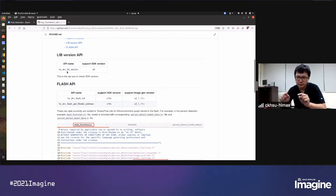And you can imagine that the 10 by 10 grid detection is made to detect dense objects. So for the minimal distance, you can imagine that the 10 by 10 grid is almost 16 by 16 pixels, so you can identify the different objects. But it's just the algorithm. So for example, you should also consider your FOV, the field of view, and the grid size, and you can calculate approximately the minimal distance you can identify.